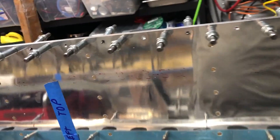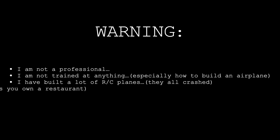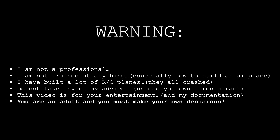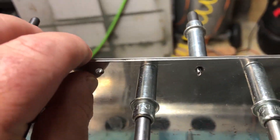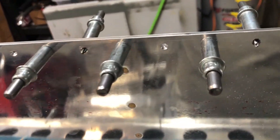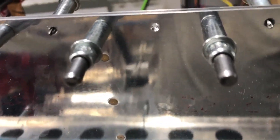I made a pretty big mistake. Maybe you guys can see what mistake I made here. I know that trailing edges are supposed to be dimpled on the skin and countersunk into the wedge. You machine countersink the wedge, you dimple the skin, and it sits in there. But I swear the instructions said not to dimple and to countersink. I've read the instructions like 30 times and I still think it's worded poorly, but I countersunk them.